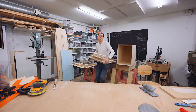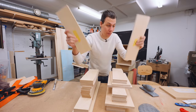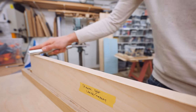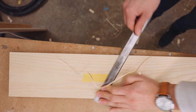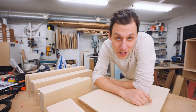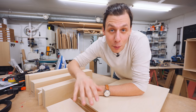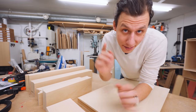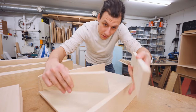It's now time to start making the drawers that will go inside those cabinets. Before we can start assembling them, I want to make sure none of these ugly MDF or plywood edges are visible, so we're going to apply some edge banding on the visible edges. A whole bunch of edge banding later, we've got all our parts edge banded and ready to go. These pieces are ready to be assembled into five individual drawers — the same construction as in my work table, with two side pieces with slots cut on the table saw that fit onto the bottom plate, plus a front and back piece.